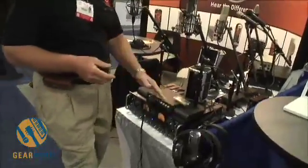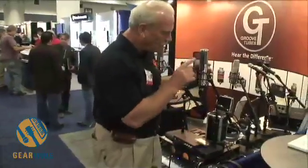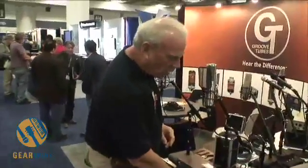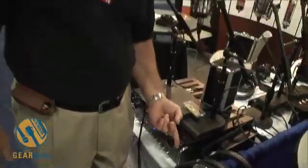If you want to go the full signal chain, way back to the 50s and 60s and get that kind of high resolution, warm feeling on recording tracks, you need a ribbon mic. And you also need a console or preamplifier that loads it like the old days — that would be our stereo unit preamp down here. This is a stereo unit; we're only demonstrating one side right now. We can load it at 1200, 600, or 300 ohms, and each of those will have a relatively different effect on how the microphone works.